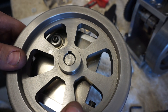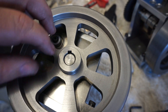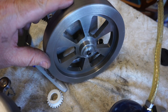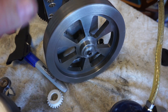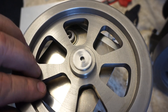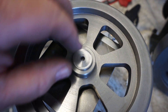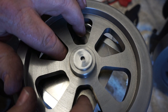What I'm going to do now — and I probably should have done this when I made the cranks — is set this up on my mill, find the centre, and drill and tap. The reason is I don't want to rely on a grub screw to hold this flywheel on. It's got a fair bit of weight — about two and a half kilos from memory. I've made up this little retaining washer that will pop inside like a little button and give me a slight bit of clearance to stop the flywheel rubbing on the outer race.